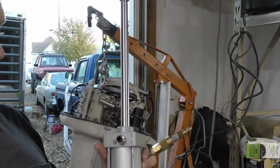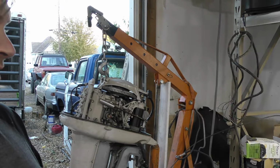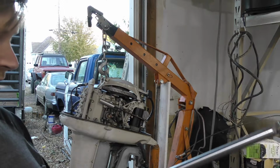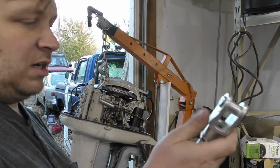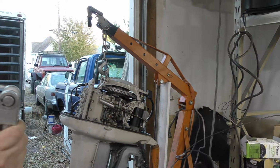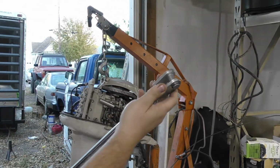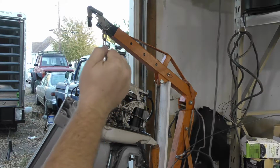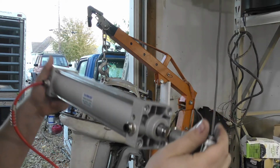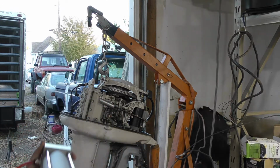We can adjust how quickly things go up and down just by the size of hose, or we can even put a valve on there to turn down the rate a little bit. But we are going to start there, make ourselves a bracket to go up onto the ramps, and then another section off the bottom here where the screws are that'll attach to the bottom of the bumper. And hopefully, if my additions and calculations are correct, everything should actually work and we would have an air actuated ramp lift system. So, most likely I'll need two of these, one for each ramp, but at the price that these things are, that's not too expensive.